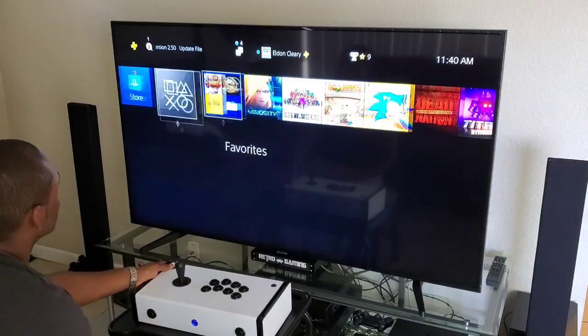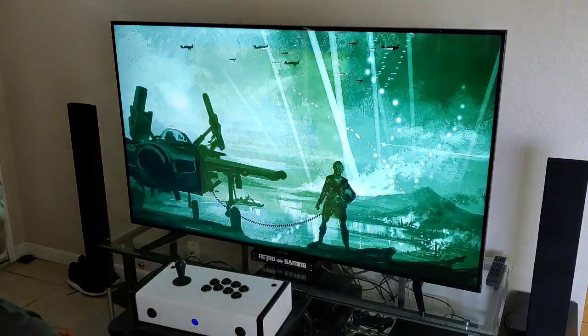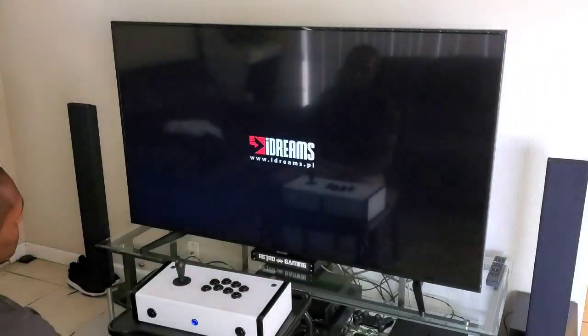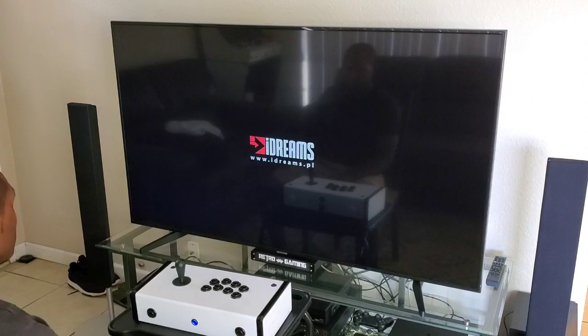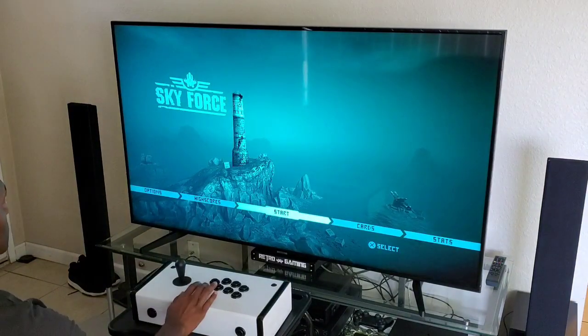The analog sticks that I'm using are the same ones used in the original PSP, which is the PSP 1000. I chose these analog sticks because of their low profile and being physically easier to install when compared to analog sticks similar to the ones used in the PlayStation 4 controller.